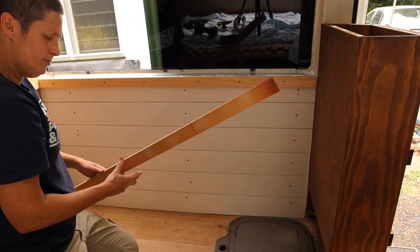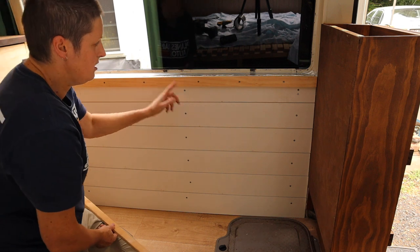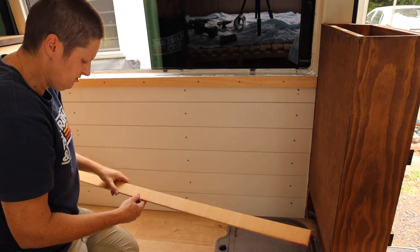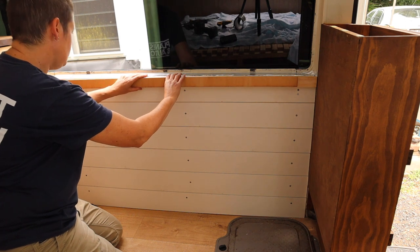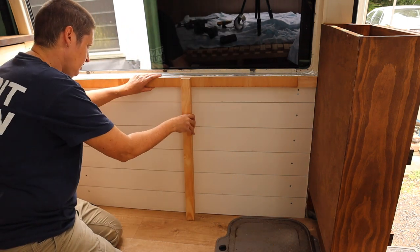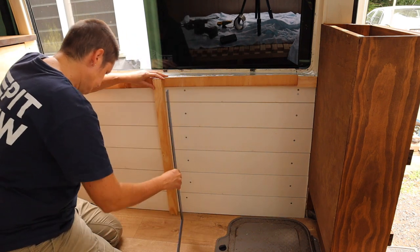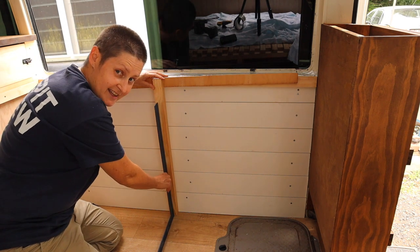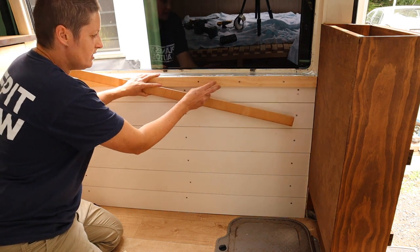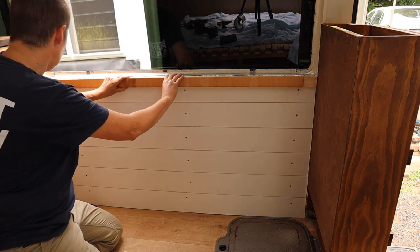I've got some 9mm ply — I didn't have a piece long enough for the whole run, but that shouldn't matter as it only needs to cover where the studs are getting screwed in, and the whole thing will be covered by the tabletop anyway. With the ply in place and the stud up there, it's now square to the floor — perfect. I'll just attach the ply with glue and a few nails. It won't need much because other things will be screwed into it to hold it on.